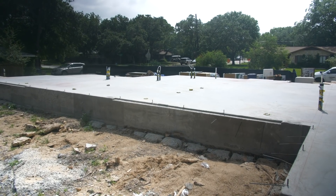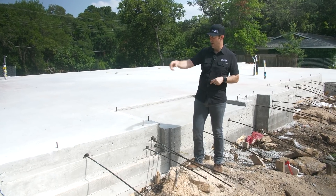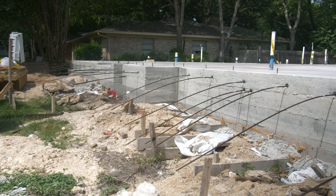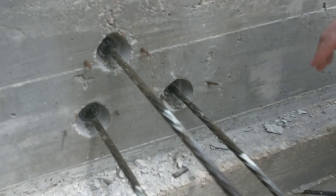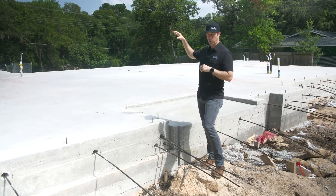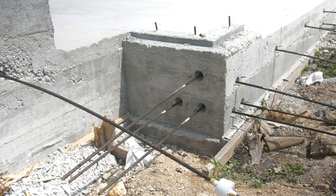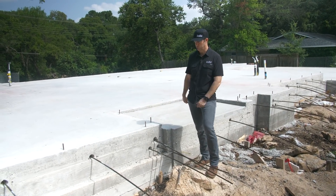This is a braided steel cable — usually seven or eight plies of steel — and these are going to run front to back and side to side. On the back of the house, there's just a post, basically a plate that holds it in place. At the front and left-hand side of the house, you'll see these cables sticking out. They're going to be on whatever centers the engineer specifies, but usually around 36 or 48 inch centers. Wherever you see a cluster of multiple cables, usually there's a point load from something above — this is probably a two-story house.